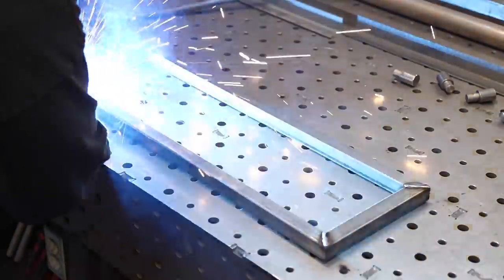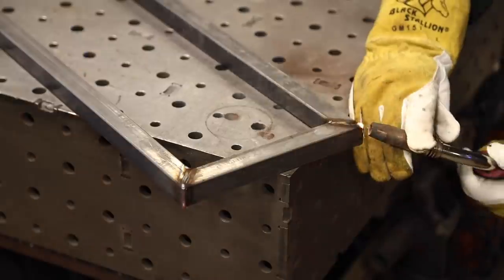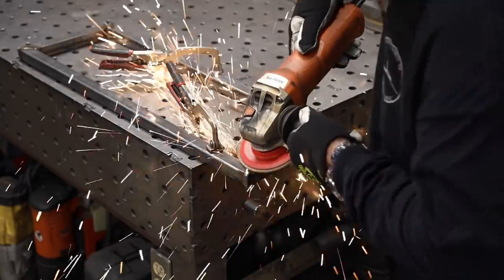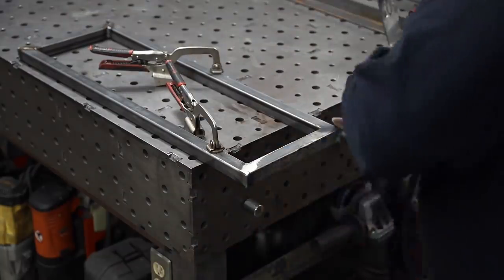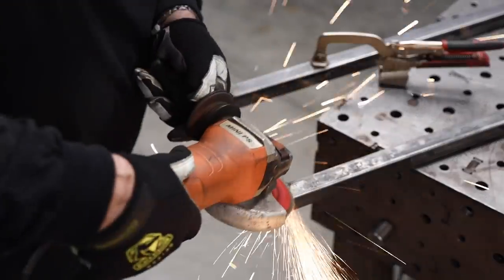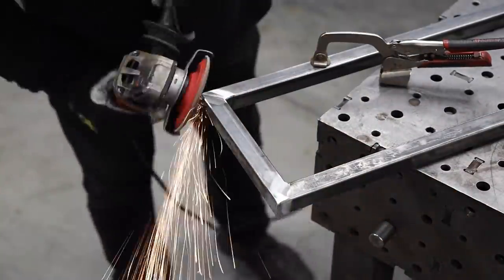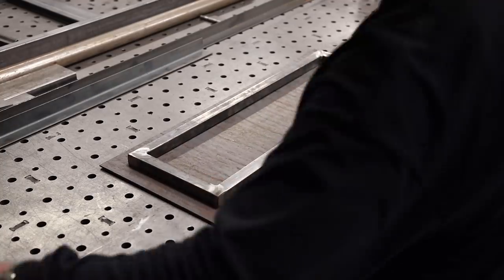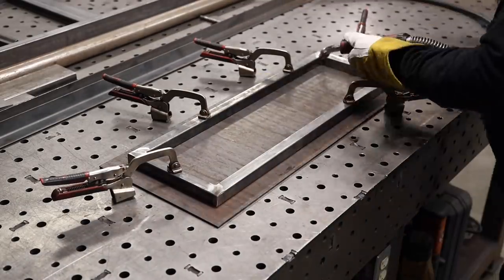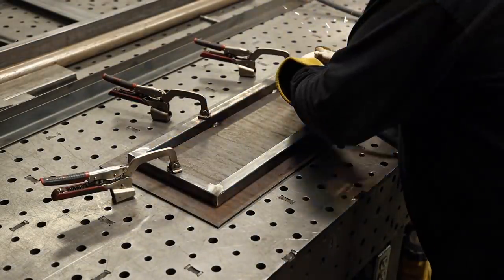Flipped it over to the other side and finished it out, then cleaned up all the edges all the way around. I'm using a Mercer trimmable ceramic flap disc — a lot of people ask what I use; I've got them in a couple different grits. You can see how clamping it down straightened that lid out and kept everything nice and flat. Just a couple of one-inch-long beads all the way around is all you need — didn't want to put too much into it.